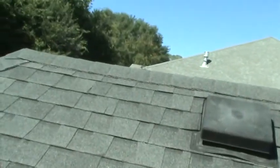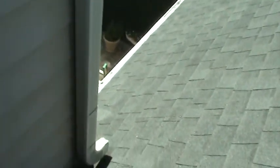So what's happening is you got water that's coming down off this upper end of the roof here over the keeping room, hitting this corner. Got nowhere to go. See all the caulk that's failed in there? So with light rain, it's probably going right through down to that gutter, no problem. Heavy rain, downpour rain, we got water going inside the house. And if it hits it the wrong way, it's going inside this 2-story or 1-story living room in here, great room behind this wall right here, or into the keeping room, which is here, and it's going to ruin those floors. The water's going to come from somewhere.